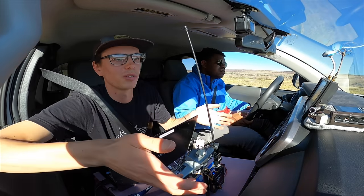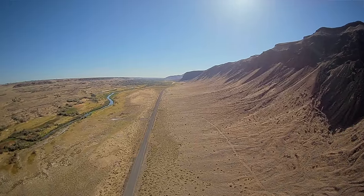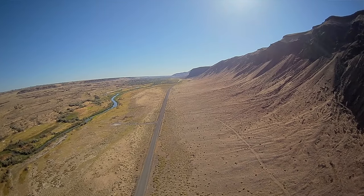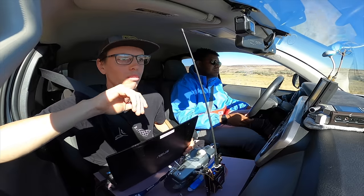The solar panel needs to be electrically isolated — that's the whole point. So current was actually flowing through the ground signal line on my power meter, which is terrible. It was pulling presumably a lot of current through a pin that definitely should not have been carrying that much current. I can't believe it worked as well as it did.